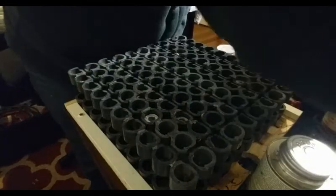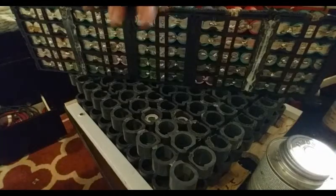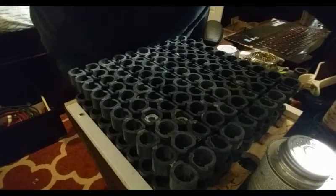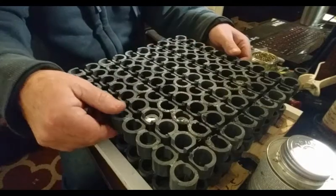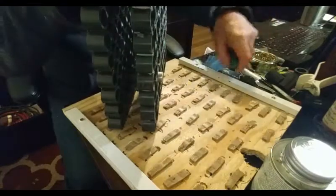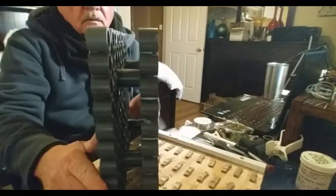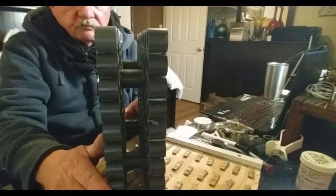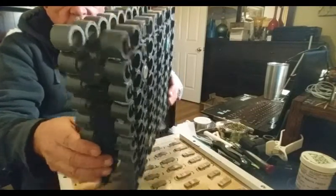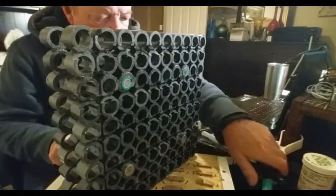This weight I'm using to hold this together until that glue dries. I think I've showed this cell before — it's also a hundred batteries in one cell, but the holder for it is built with a printer. The reason I've changed from using that printer to building this holder is that I realized after I built my first battery that if any cell goes bad, there is no way to change that battery. You can cut the wire on it and just disable the bad battery, but you can't really replace it without taking everything apart. With this one, you can just cut the fuse side and the ground side, slide the battery out, slide another one in, solder it up, and you're back in business.